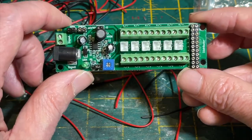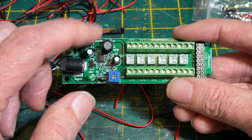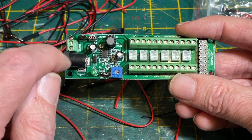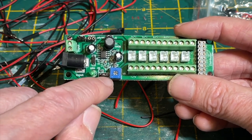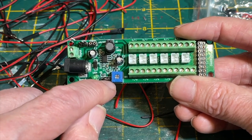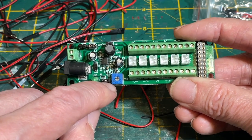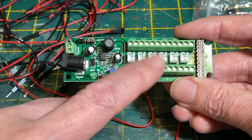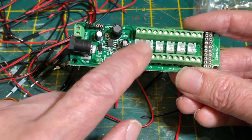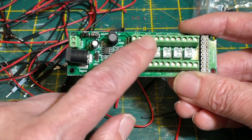These are just brilliant. When you daisy chain them you can set them independently — so you can have voltage coming in, and on one board have a load of 12-volt lights, and on another have three-volt lights. In fact, I thought both my boards were running at three volts, but one is actually running at 12. You can also mix voltages on an individual board — 12-volt lights on one side and three-volt lights on the other — but you would have to put a resistor in, which to my mind rather removes the point of having this thing at all.